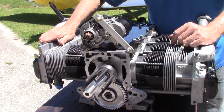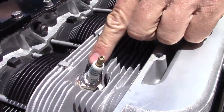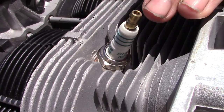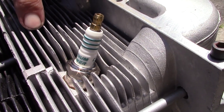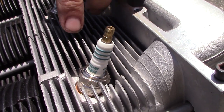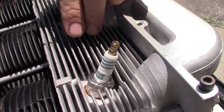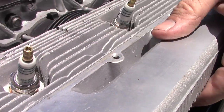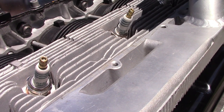We're going to get a front alternator bracket on here for Bob. Come in close — this is an iridium spark plug. These are the correct spark plugs as shown by the MOP manual. We're seeing too many engines come back with AC44 plugs or the wrong iridium plugs. If it's a 2700, it's got to have a 20-series plug. If it's a 3-liter, it's got to be a 22. If it's a 3.3, it's got to be a 24. You can even bump those colder — a 3.3 can run 27-series plugs, a 3-liter can move to 24-series. We were originally running 16s, but you can run them colder and the engine has great resistance to detonation and actually runs cooler.